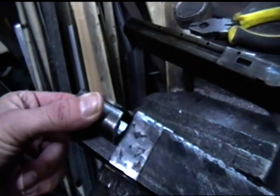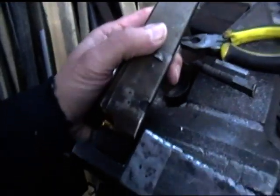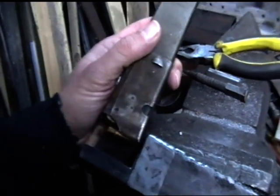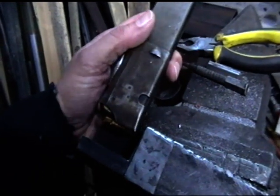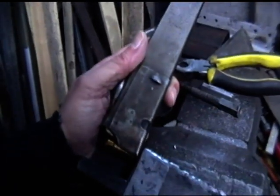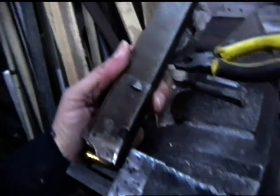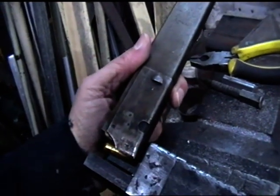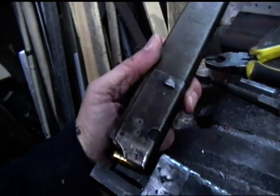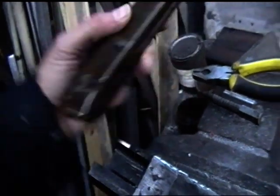So basically this is the bolt which is fitting in the 50 cal Browning machine gun, and then it's having a side fed 9mm magazine which fits in behind where the 50 caliber drum box magazine would fit. So it's going to fit in pretty much approximately in that position there, and it should feed 9mm straight into the barrel.